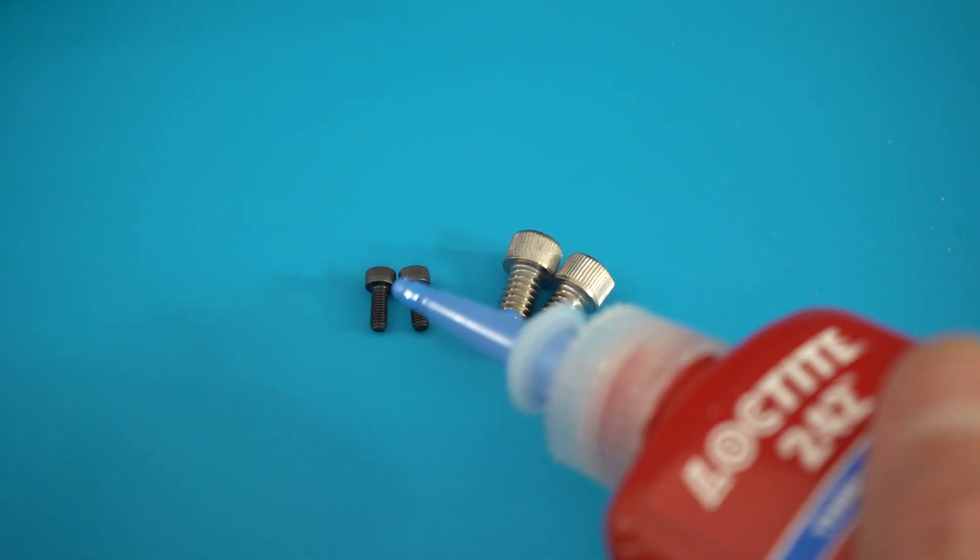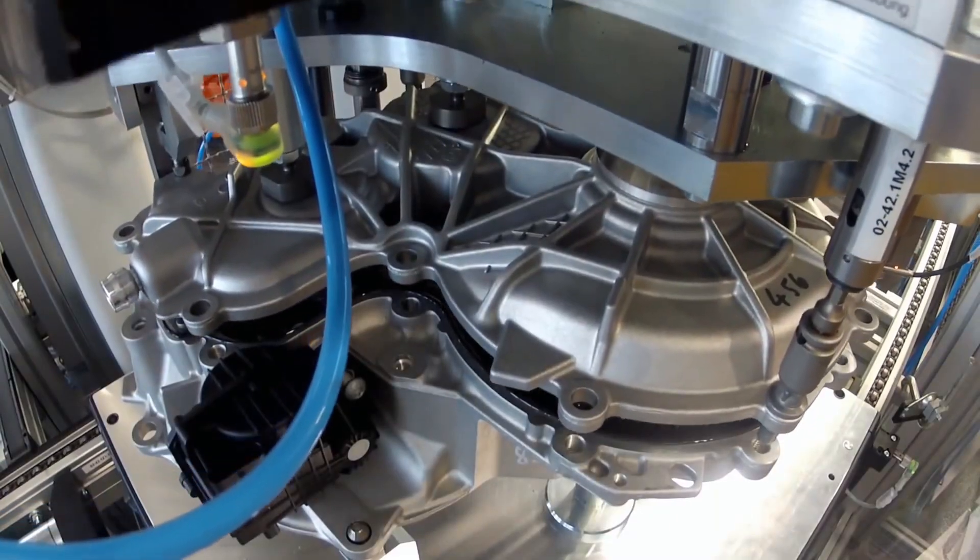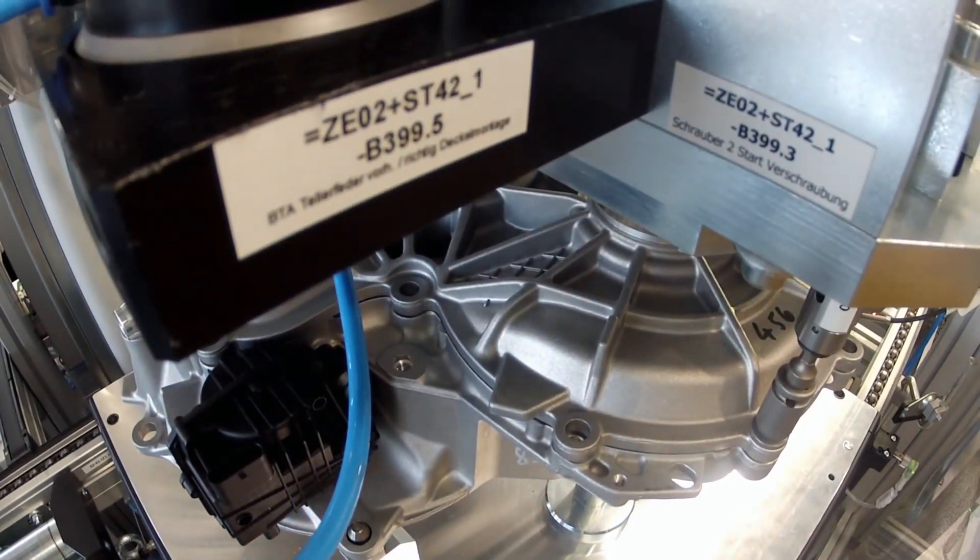Threadlocker has been around since maybe the 50s or 60s and is used mainly for metal fasteners going into a metal receptacle — like an aluminum or steel block. We only use it when inserting a fastener into a metal hole. Metal into plastic we'll get into in a bit, but right now we're only talking metal to metal. It's used across many industries — cinematography, machining, automotive, hobby boating — and it's basically used to prevent fasteners from backing out, mainly due to vibration. If you have a motor, engine, high-spinning rotor heads, tail rotors, or shafts, Loctite is going to keep things tight.